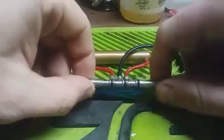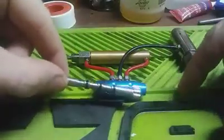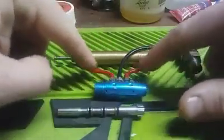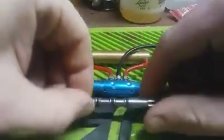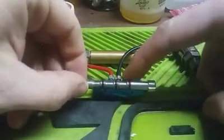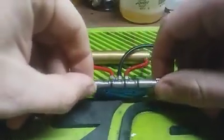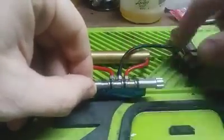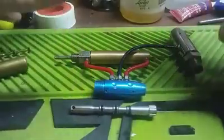When we cycle to the other side and everything is locked back into a closed position, we still have a place for the air trapped on that side of the ram to come out and vent through those holes. Now if we were to do this on a hinge frame, obviously we'd be pushing forward, so we'd again swap these two hoses — front goes to rear and rear goes to front. Sitting about here, the front barb would be distributed to the back holding everything closed, you'd pull the trigger, it shifts forward, and now the rear barb is connected to the front — that's how everything cycles.